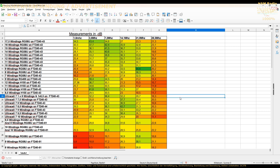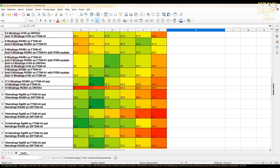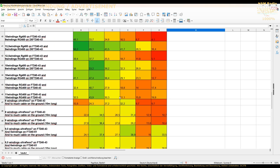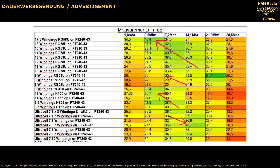In most cases, after five to eight windings, you will shift the highest impedance point to the lower bands. But the efficiency of the choke on the higher frequencies will get worse. And now comes an important message.